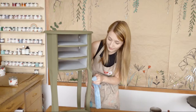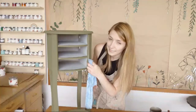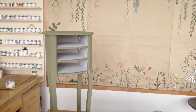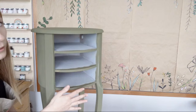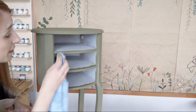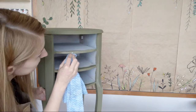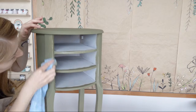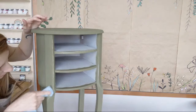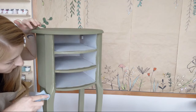You might see the previous color — Whoop-de-Doo, a really nice bright turquoise teal — pop through here, because I didn't quite let everything dry. If that peeks through under Soiree, I'm just going to dry brush Soiree over top of that. If it's starting to peek through, just touch it up with some paint or wait longer for it to dry. Some folks even suggest painting their base color and sealing it with a clear coat so it's nice and strong and can't be wiped off. I just want to give it a little bit of wear because I plan on putting that stencil over these nice drawer fronts. I just want to frame them because when I set the drawers back in, this is going to be outlined nicely — there's a nice groove here that could be highlighted.